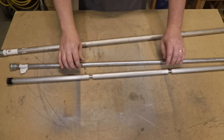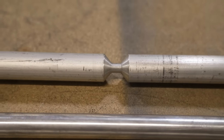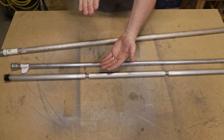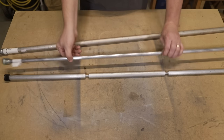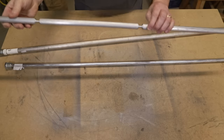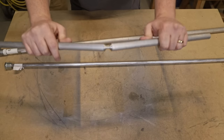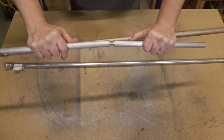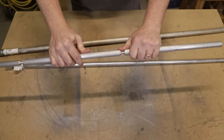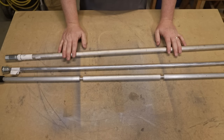You may have also noticed that these rods are slightly different shapes. This one has little cutouts, whereas this one is just a solid piece of aluminum. The reason is that water heaters are sometimes installed in areas that don't have much headroom above the heater, and you wouldn't be able to get a rod that's three and a half or four feet long up above it. So they make this kind that can flex and bend — these little junctions let you bend the rods around a corner and then straighten them back out so they go straight down into your tank without touching the sides. I just wanted to illustrate the different types of rods so you'd know what to look for when shopping for your anode rod.